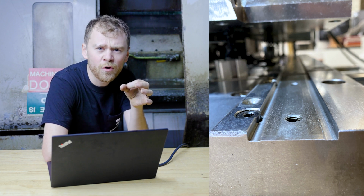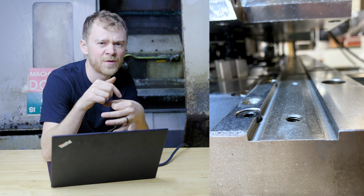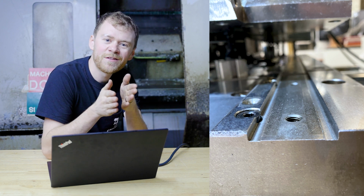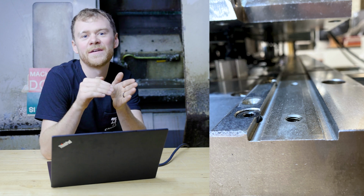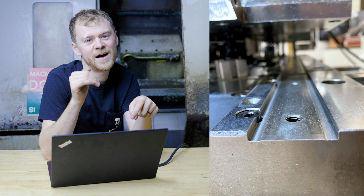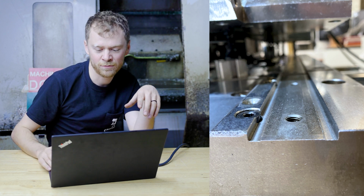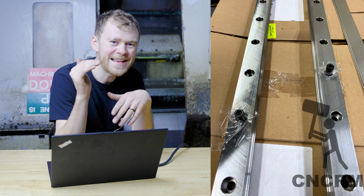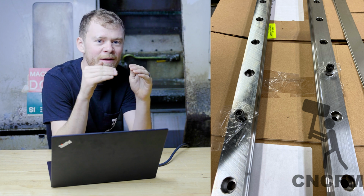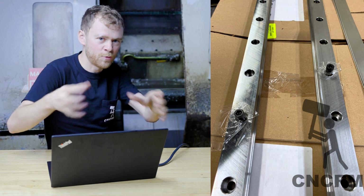Now there's a cam bolt that sits in a round hole that they broached a hex head into that's off center. So as you tighten that, you're pushing the rail up against the shoulder. But you have to have all of those at just the right position to slide the rail in. And the tricky part is if you slide the rail in first, you then cannot fit the cam lock bolts in. So put the lock bolts in, get them all set right, clean everything out, and then you can slide the rail in. Now, because of how tight everything was underneath the wedge, I did not have room to slide the rail in and then drop the bolts, especially because the wedge was jacked up and I couldn't move the wedge.